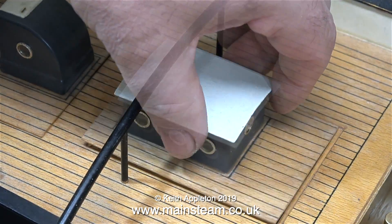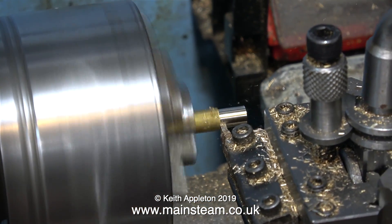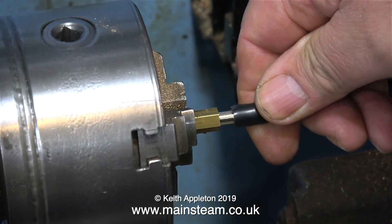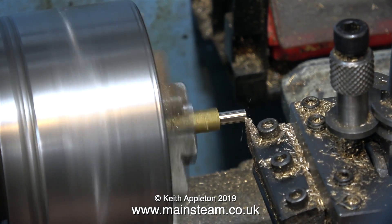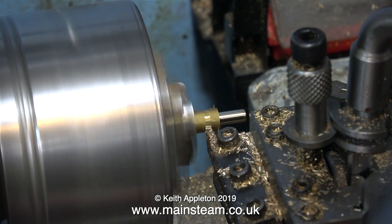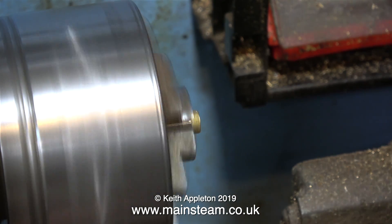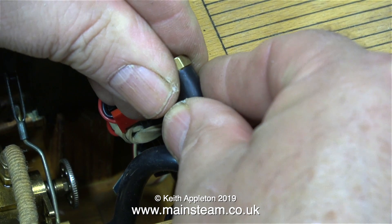Time for a change of scenery. I need to make a plug for the end of the drain pipe on the small condenser. With a piece of brass hexagon bar fitted into the chuck I'm using a parting tool as a turning tool to reduce the diameter of the end of this piece of brass so that it fits in the silicone rubber pipe. So the sharp edge of the brass doesn't cut the silicone pipe, I've rounded it slightly and I'm using emery cloth to remove the sharp edge. I've parted off the piece I want, turned it round in the chuck, cleaned up the other end, and this small brass plug now fits into the drain pipe of the condenser oil trap.